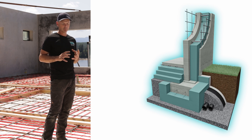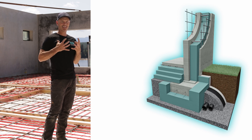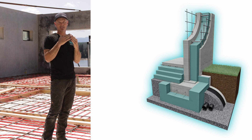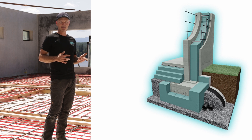The way around that is to isolate your heating areas in the home. You'd want to isolate things like your kitchen and your bathroom — places where you're standing around a lot — so when you walk in you get the sensation of nice heated floors. That's all you need to heat your home, because these houses are so super-insulated from footing, under-slab, walls, and roof. When you do heat, just heat those specific areas where you'll get that nice satisfaction.